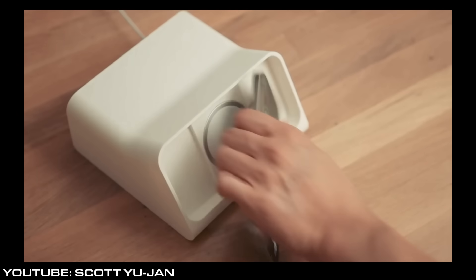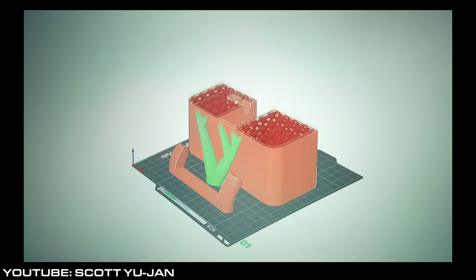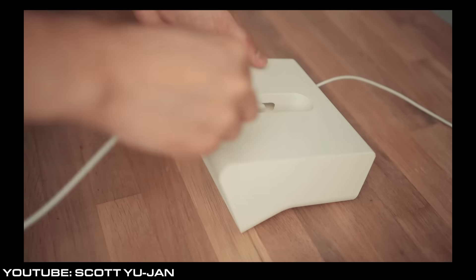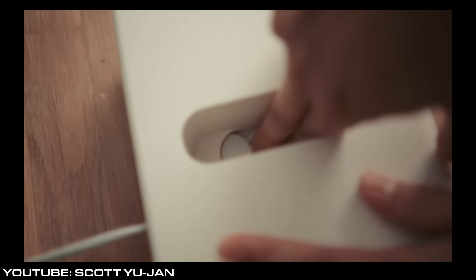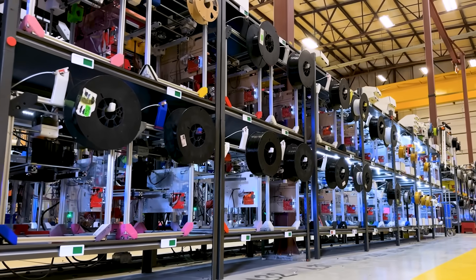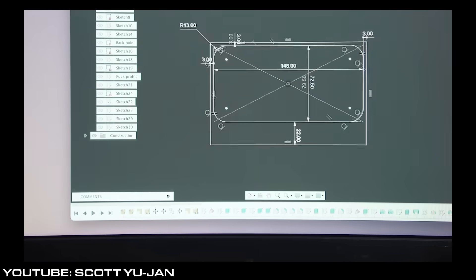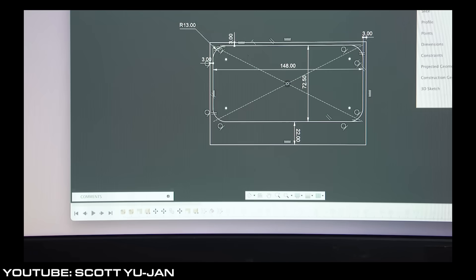This style of design is very enabled by 3D printing, because they were able to print in two pieces something that would normally have to be assembled in five or six different pieces with traditional manufacturing — sandwiching together the top, the bottom, the place where the watch goes in, and all the rest. Much of that geometry is unmoldable as it is right now, but with printing they could mass produce that product in a giant print farm and not have to worry about the geometric constraints.